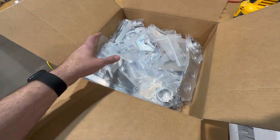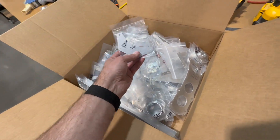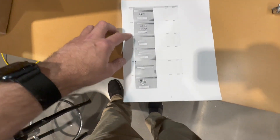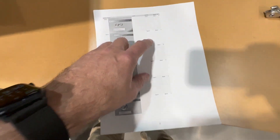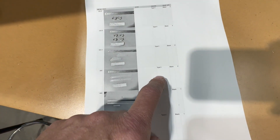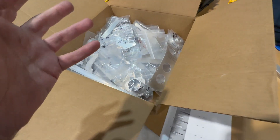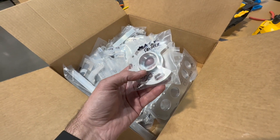Here's everything after I've identified, separated, bagged, and tagged all of the parts. Got my spreadsheet. I'm going to give all this to the anodizer tomorrow. Got everything listed out with part numbers and the process. Most of these I'm doing type 2, which is just a standard sulfuric anodize. The type 3 with the PTFE coating will be on things like the pulleys.